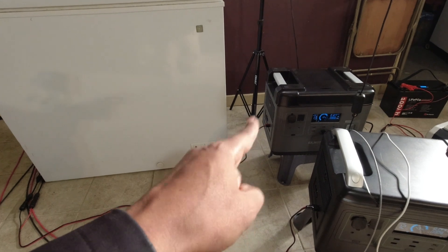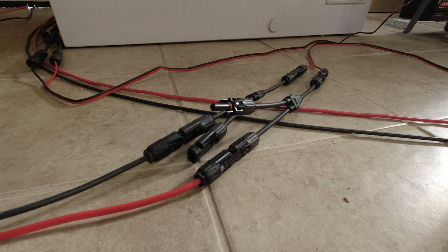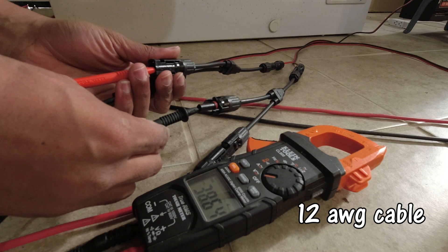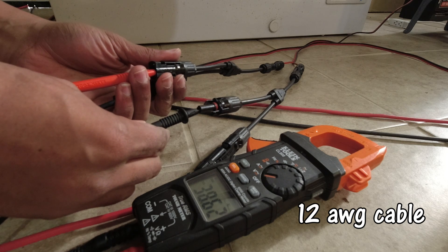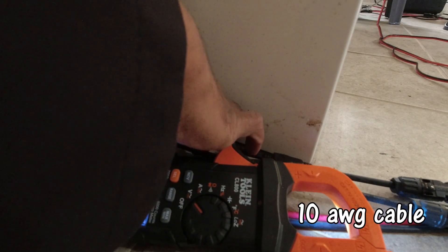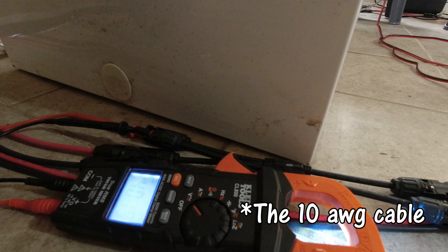That array has a 190 and a 180 with very similar voltages. Using the parallel cable hack Jason Noy mentioned, I can measure with the voltmeter under load. I'm getting 39 volts on the 12-gauge side — fluctuating around 38.6 to 39 volts. Hopping over to the 10-gauge side, it reads 40 volts. So it lost roughly 1 to 2 volts.